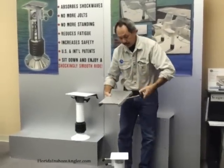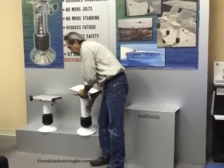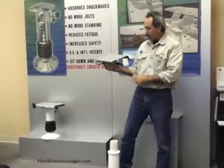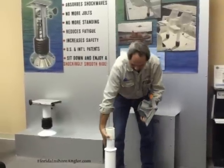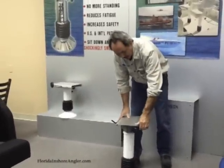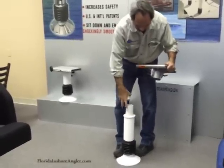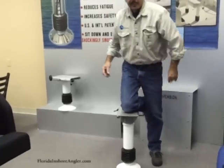Now, for those who have a spider type of swivel mechanism, then we have a pedestal that is perfect for that. This again is a Garmin spider slider, and how it differs from the standard one is that the rotation happens in the unit itself. So you mount the bearing on top right there, giving you swivel capability as well as fore and aft. And then of course it locks up in any position. By having the ribbed design, the fluted design right here, incorporated into our pedestal, it allows for a secure lock. And again, shock mitigation in any position.